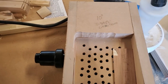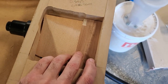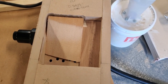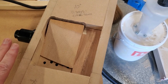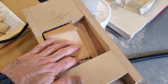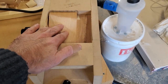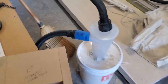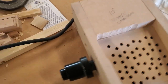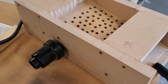You would put a piece in like that and have all these holes covered. When you apply the vacuum cleaner to this port, it sucks down and you get 14 psi of holding power on this part without having to have any sort of physical clamp — so I don't have to have a clamp on the work piece, which is really handy. The vacuum clamp is dead simple: it's just a bunch of holes, a hole in the side that the vacuum cleaner plugs into, and a comparatively sealed chamber underneath all that.